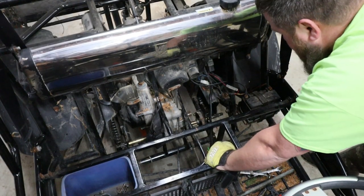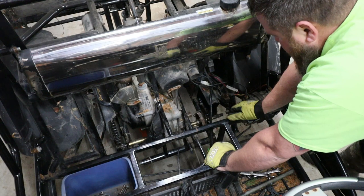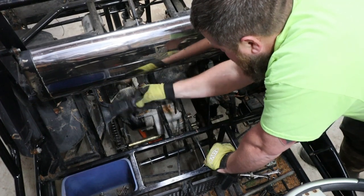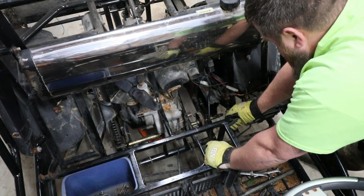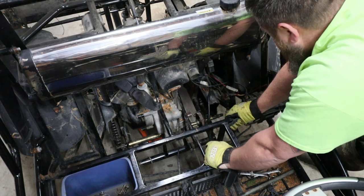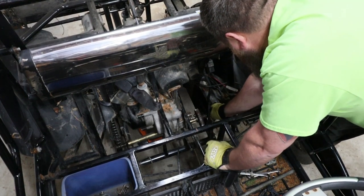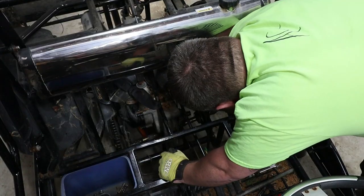It's got a lot warmer in the shop, but as you can see we got the drive chains off, pulled the upper sprocket off, and loosened and removed the support bearings for the output shafts. This is the really challenging part — I've taken the motor mount bolt out and jacked the motor up because we're going to need as much room as possible to get this axle out. It's been a while since I've taken it out and I can't quite recall how it comes out.